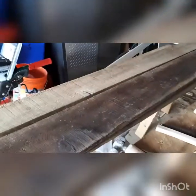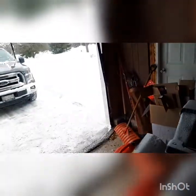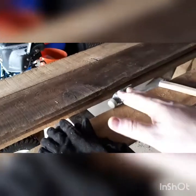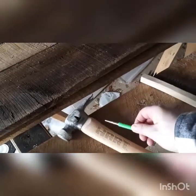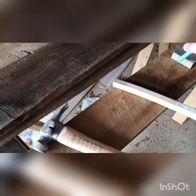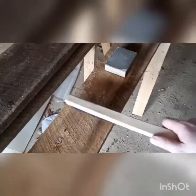I'm going to show you how I clean up barn board for use inside the house, because it came out of a barn so it's covered in dirt and spiders. First, get yourself some gloves - these cause some pretty gnarly splinters. Also get a hammer; it doesn't have to be a big framing hammer. You'll also need a nail punch, because a lot of barn board still has nails through it. You can pull most out or punch them through, especially since they'll break off when you try to pull them.